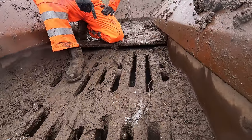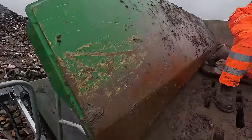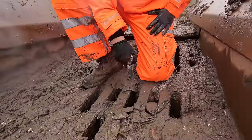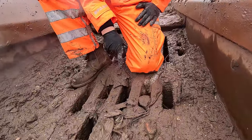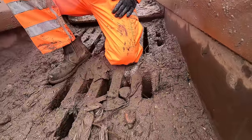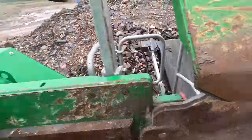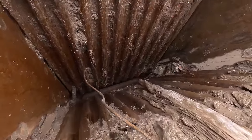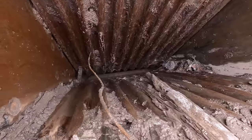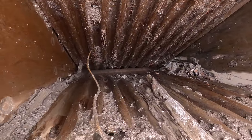So your material that runs through there runs onto the side belt, comes off the other side, right? And at the front of the pre-screen, you have another little chute here that I just mentioned before, and that runs down behind the jaw, so you're getting finer materials running down behind the jaw, whereas everything else runs through the jaw. Now then, these 45s will crush down to 50mm. You get about 50mm, 50 to 60mm coming off the belt, minimum.